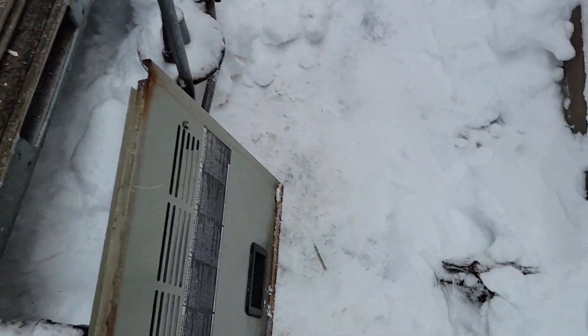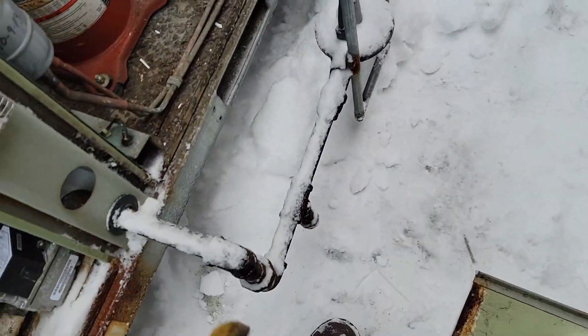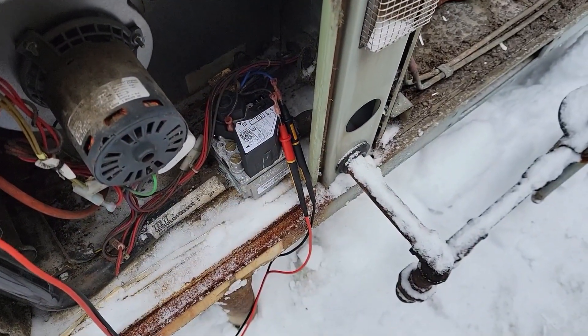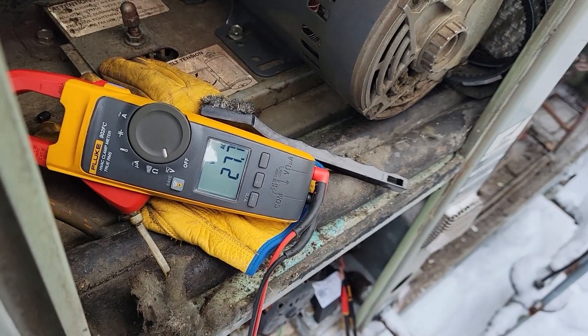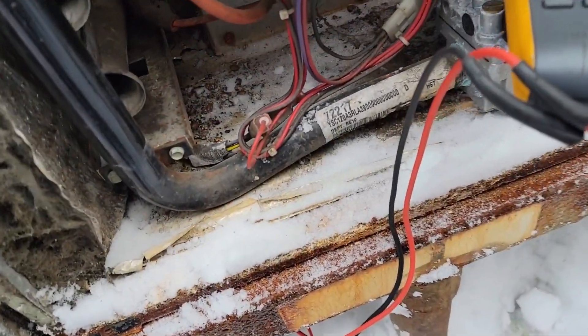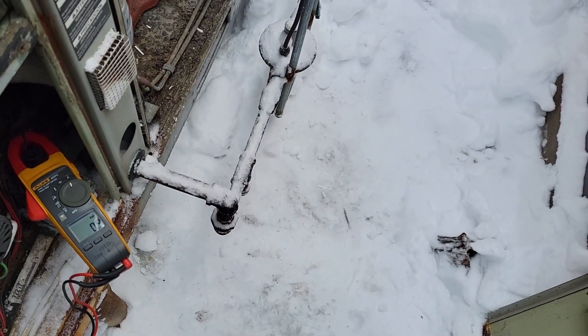What I'm going to do is check if there's a regulator that might be froze up. Let's crack that union and see if we got fuel after the regulator — there's a chance that thing froze up, I've had that happen before. Actually, we didn't hear the valve click, so let's check if we've got voltage coming to it first before we waste our time taking apart the gas connection. Okay, we are getting voltage. Let's put it back together and check amperage. When I hooked that common wire back up I heard it click. We're going to see some amperage — 0.8 amp, 0.9 amp, sparking. So the gas valve is working — he's got a problem with the gas.